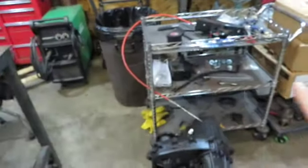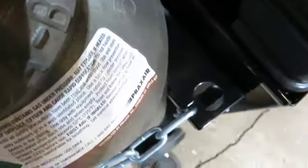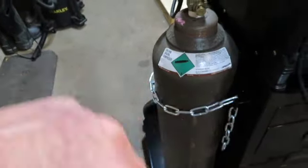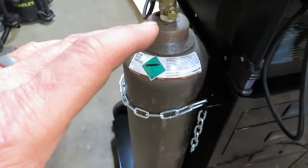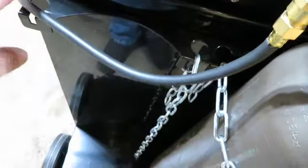Once all this stuff is gone and I have the second gen put back together, I'll have a lot more room. This fits pretty good — it looks like it will take the bigger bottles. If you look at the radius right there, there's just a little bit of room. That one is a 125 or 120, and that's an 80. The difference is the 80 is shorter, same diameter, just a shorter bottle. So next time I get a bottle for the TIG welder — which is 100% argon — I'm going to jump up to the 120.